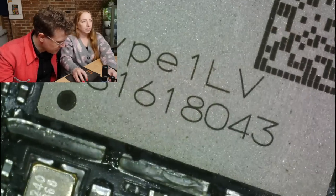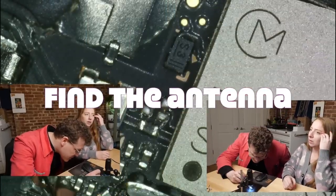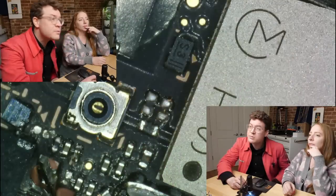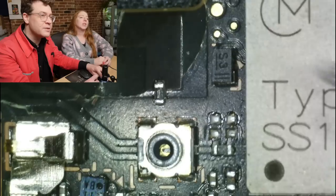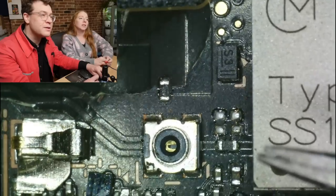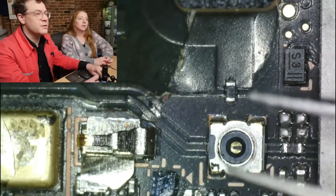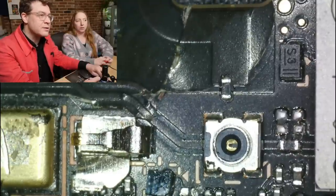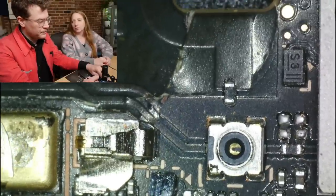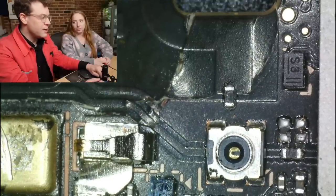Should we play Find the Antenna? That little SMA connector could be a place where an antenna was plugged in — or that could be a test point. Structures that look like this near RF components are kind of telltale signs, because when you're at really high frequencies, the actual geometry of the wire on your circuit board matters. Things will jump off corners, those can accidentally turn into antennas, and the actual inductive and capacitive properties of the line itself changes. So you have to be really careful.